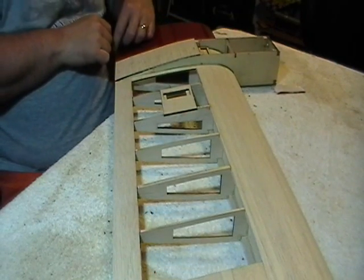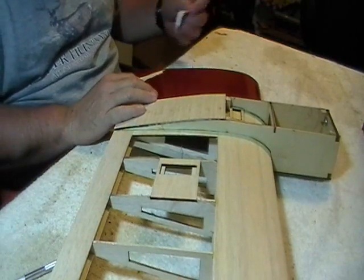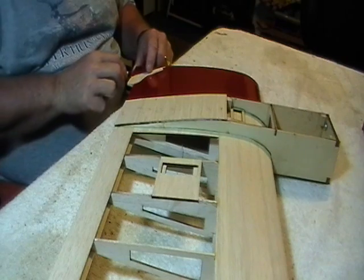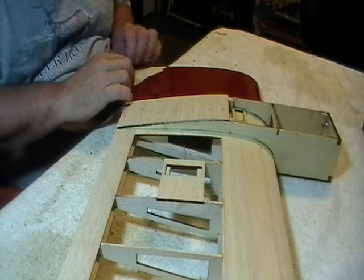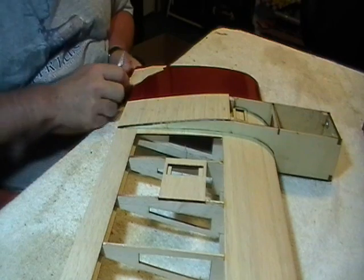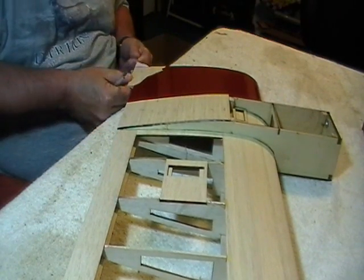So being careful not to cut your wood. You don't want to cut into that or skin it, but if you do, it's easy to patch. Just make some filler out of some sawdust and just a tiny bit of epoxy. And if you need to thin it slightly where it's more runny, you can use a little bit of denatured alcohol. Don't put a whole lot, your glue won't bond good, but you can put just a little bit in there.